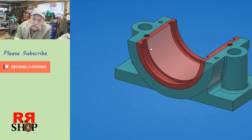So like I said, we'll have some shims. And what I'm going to do is put in a set screw here on each side to help hold these in so they won't rotate.